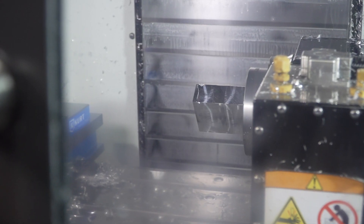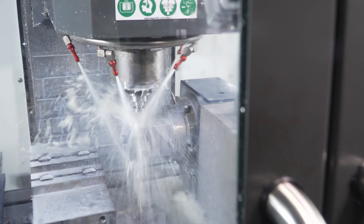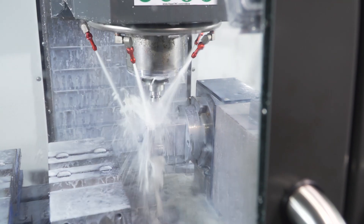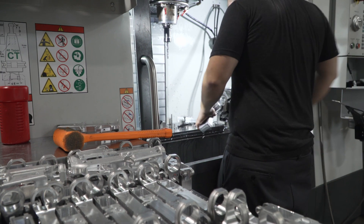All the mills here have four or five axis tables on them. There's very little here that runs three axis. In order to be competitive anymore, your number one goal is to touch the part the minimum amount of times possible.